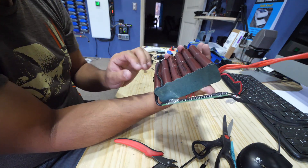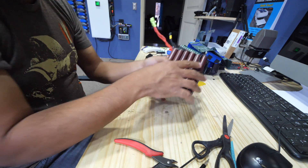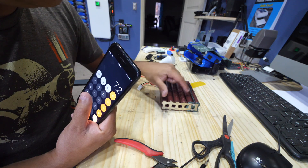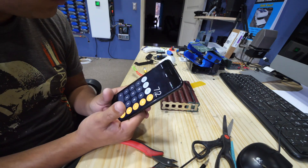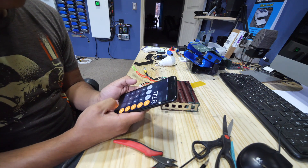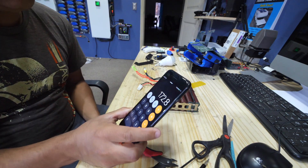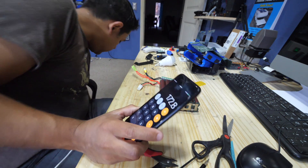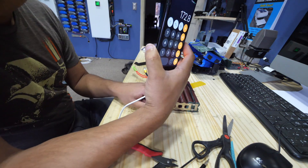So let's do the math here. These cells say they are 7.2 watt hours each. So it's 1, 2, 3, 4, 5, 6 — 12 is 24 cells. So it's 7.2 watt hours times 24 cells, that would be 172.8 watt hours. Which is funny because the case says 200 watt hours, but the batteries themselves don't say that.